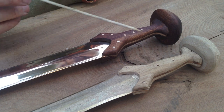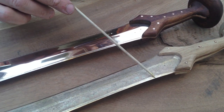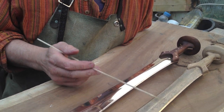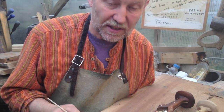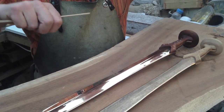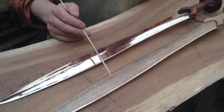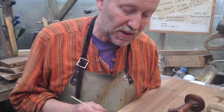The sword that has gone to Canada has got the wide rib down the middle and forged edges, but I have also added some other tricks, because sword makers would have done this themselves. The first thing I have done is artificially bent the blade and straightened it to work-harden the bronze a bit and make the blade more rigid — I do not want it to bend if it is struck on something. I have bent the sword several times, and it has stiffened the blade up. It is a trade-off: the more you stiffen it, the nearer it is to its fatigue point.